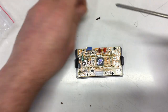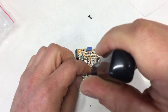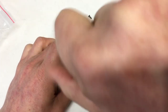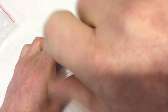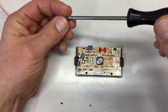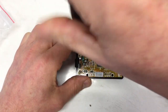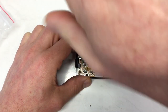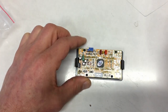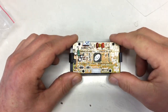Yeah, with these self-cutting screws into plastic, I'm always trying to find exactly the same threads again, so I don't cut another thread, because if you do that two or three times, basically you end up with no thread at all. Okay,